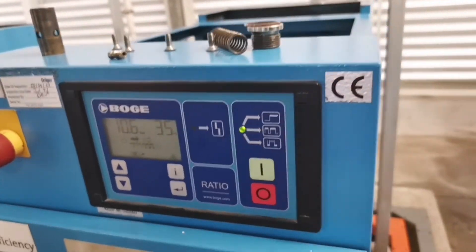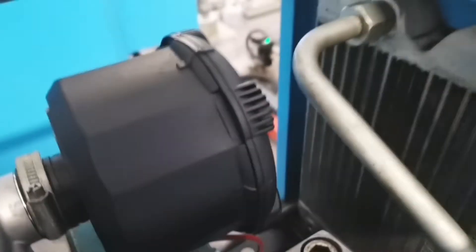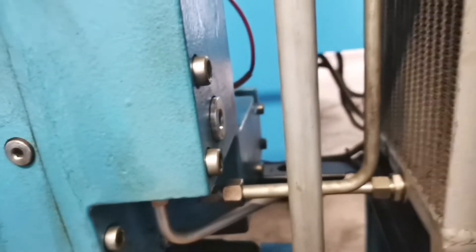For rectification of this fault, usually we check that the cooler is not choked. The oil is at a good level — you have enough oil. So if this still doesn't work, then it is most likely the temperature module located inside here.